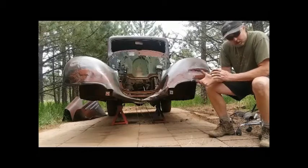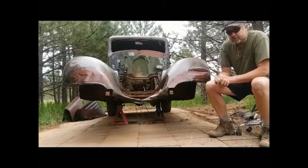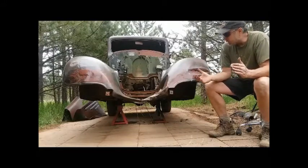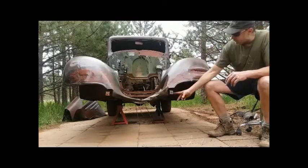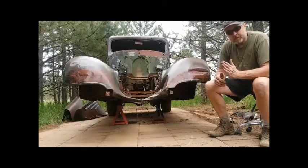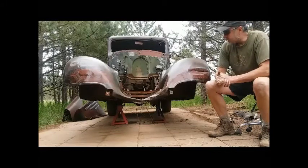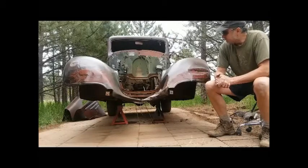For now I just kind of want to get all the pieces moved into their place. I'm going to get this lined up. I do have my parts on order for doing my leaf spring mounts. I will have to temporarily mount them though, because until I get weight on this I won't know where to mount the front shackle side. I may go ahead and connect the rear leaf spring side. The shackles are actually going to be up front here, so I'll have to kind of size things up. Then I need to get some weight on it so I can see where the neutral point is going to be for mounting that front connector for the shackles. I do have the motor and transmission, but it means I've got to sort of put them together and put them in as a mock-up. A lot of effort for a mock-up, but we'll see. One step at a time.